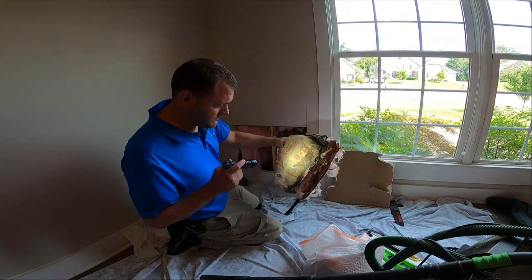Let's pause the video here and take a look at the situation. You can see how wet and nasty the insulation is along the base of the wall. Since the house was only four years old, there hasn't been enough time for the moisture to wick through to the inside surface. The area of the insulation that was touching the sheathing on the exterior side of the wall cavity was wet, but the rest of it seemed reasonably dry.